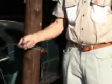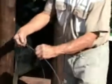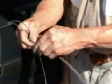To pull up a fence, begin by bending a generous length of coiled up wire. This forms the binding piece, which is fastened onto the straining pole to pull up and hold the fence in place. The binding wire is joined to the other end by a strong knot in the middle.